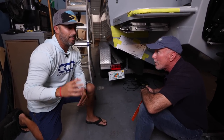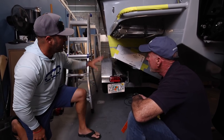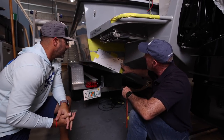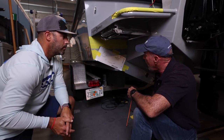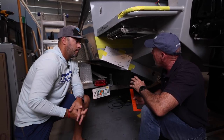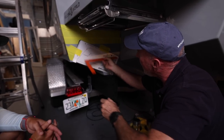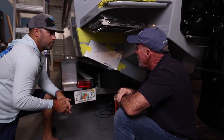I'd like to ask some legitimate questions on camera so you guys can learn along with us. Steve, why did we choose this size? We have different sizes of interceptors available. This one is a 400E — 400 millimeters long. You can see that we've covered most of the usable transom area, which makes this a perfect placement for this particular interceptor. We'll do the same on both sides of the boat. One important thing to check before starting installation is that the transom surface is flat. We put a straight edge across and top to bottom to check for wobble or irregularities. We checked earlier and we're within two millimeters of perfection.